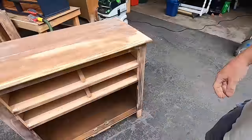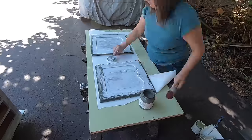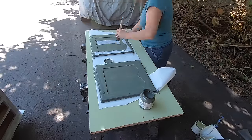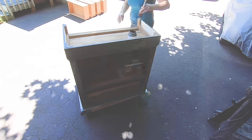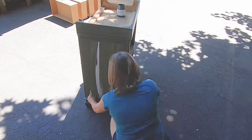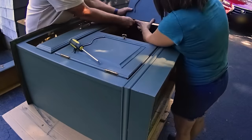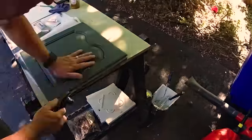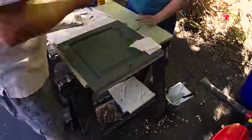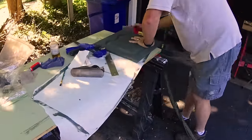A little on the blue side too, I guess — it's gorgeous. And the other thing I kept was the hinges, and I just used some Antique Gold Rub and Buff. I really liked how that green turned out — it was very pretty. So it was easier painting it upside down to start with. Those are the original handle knobs and I kept them because they were just really cool, as long as that metal plate wasn't underneath it. The doors had swelled over time so they really didn't close, so I had to plane them down and make some adjustments to get them to fit, where they would close back up again. We used the original magnets and hinges.